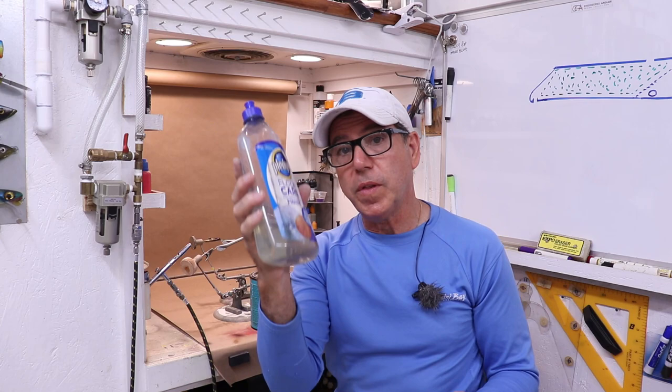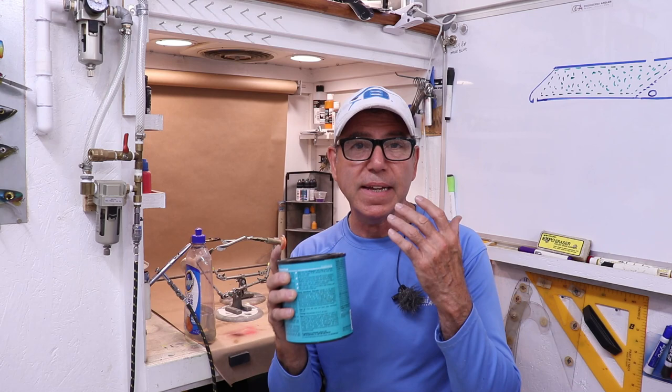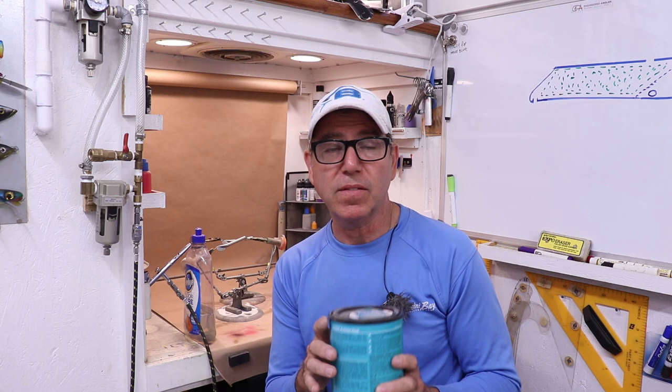And when I'm done putting on paint, then I seal the actual paint with polyacrylic. That's my last mid coat. I let that dry really well, and then I know I can get a good, clean, clear coat without any blemishes. This is a really good base for epoxy clear coat, whether it's two-part or UV cure.